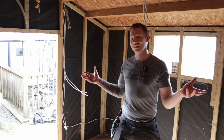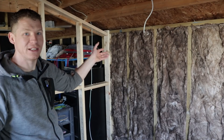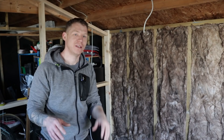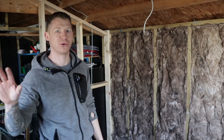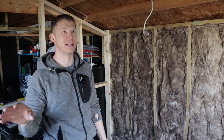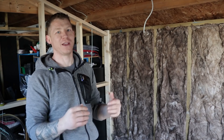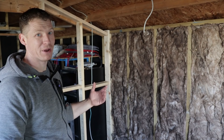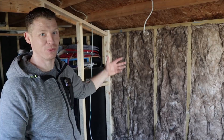We're on to day two of this build. I'm getting the fiberglass insulation into the wall — 100mm or four-inch fiberglass. There's a breathable membrane on that wall so I'm not too concerned about placing it directly against it. It is a garden shed after all. However, if this was a house you'd really need to do some research about where you put your insulation — some felt can sweat and condensate and cause real issues. Today's job is also getting OSB sheets on the wall: half-inch or 12mm OSB — nice and light, good and cheap, and robust enough for kids.